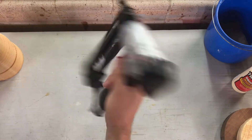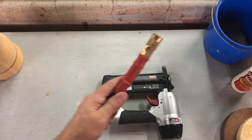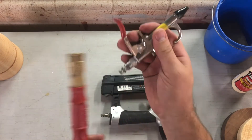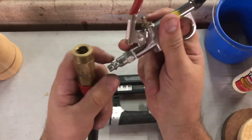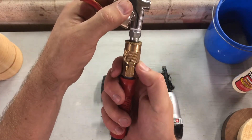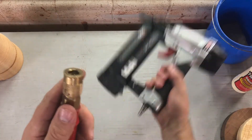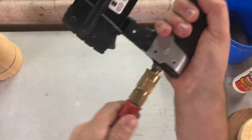Once I have my nails in I can attach the air hose. The air hose is right here but I want a little more slack, so I pull some off. The way these air hose collars work, they slide back and there are ball bearings inside. I'll show you on the little cleaning nozzle first — you can see the ridges on this fitting, and the ball bearings rest in this trough which keeps it from flying off. To take it off, pull back on the collar and hold on to whatever you're removing or it'll go flying. To add it onto the air nailer it's the same thing — pull back on the collar and some air will leak out when you push it on. That's no big deal.